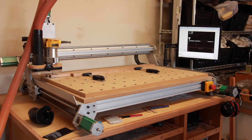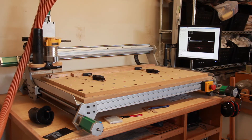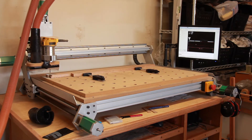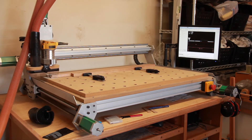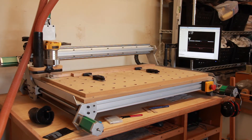We're profiling the left end again, and that's basically why this particular fixture doesn't have an XY stop — it's only got the Y stop. That's because I need access to both ends of this part to profile it and cut it to length.